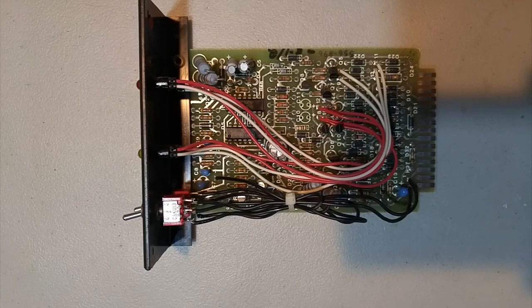And lastly, there is the acknowledge circuit. The next one is the acknowledge circuit inside the panel, where when you press the acknowledge button, it sends out some voltage, which causes all cards that have been alarmed and not acknowledged to stop putting power onto the alarm circuit. That way, another card can trip the panel back into alarm.